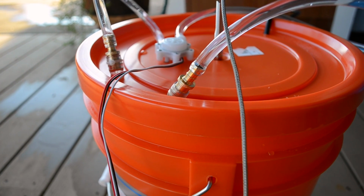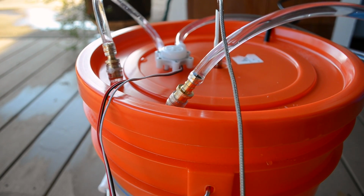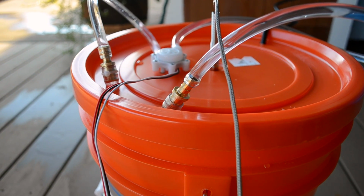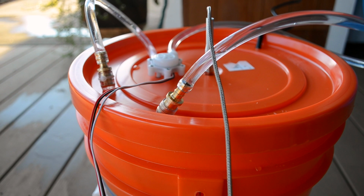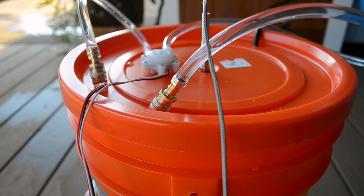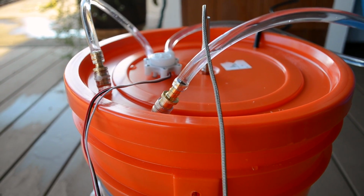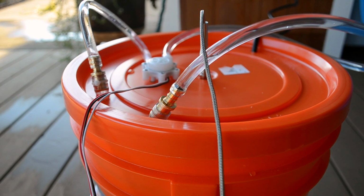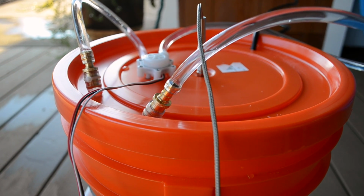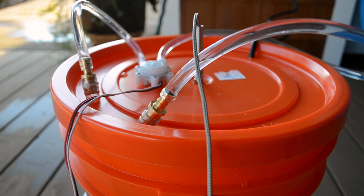And if the PWM signal stays the same at this 20 hertz, then I'll know how many seconds it takes to empty 5 gallons and what the PWM rate is, and I'll be able to figure out how to map the rate to the flow, kind of. I'll at least be able to know in very rough terms how much water is flowing through the laser.